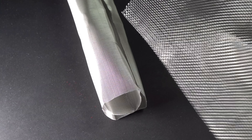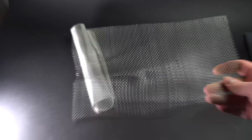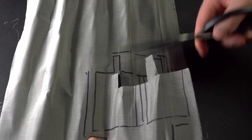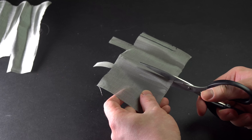Now let us start making the battery itself. We'll start off by making its principal part, that is a carbon cathode. A metal mesh will serve as a current collector. I ordered two stainless metal meshes — one with smaller gaps, the other with larger gaps. I cut out two current collectors from both metal meshes, roughly the size of a credit card.